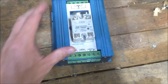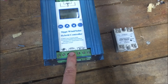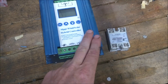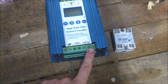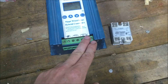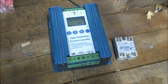I got this little solid state relay. What I'm going to do is run leads from the batteries to this connector — this is the battery connector for this controller. Then I'm going to have the load terminals go into this relay, and this relay is going to control two of my turbines. I have a 400-watt turbine and a 700-watt turbine that both have really decent output. They both work pretty well on a 24-volt circuit, so I'm going to give them their own 24-volt batteries. This relay is going to control power going to one of the thousand-watt grid tie inverters.